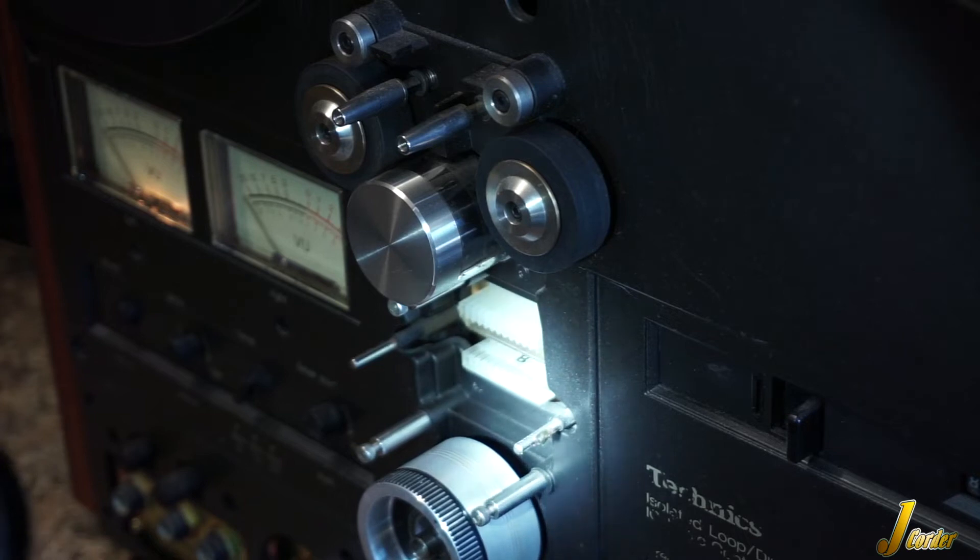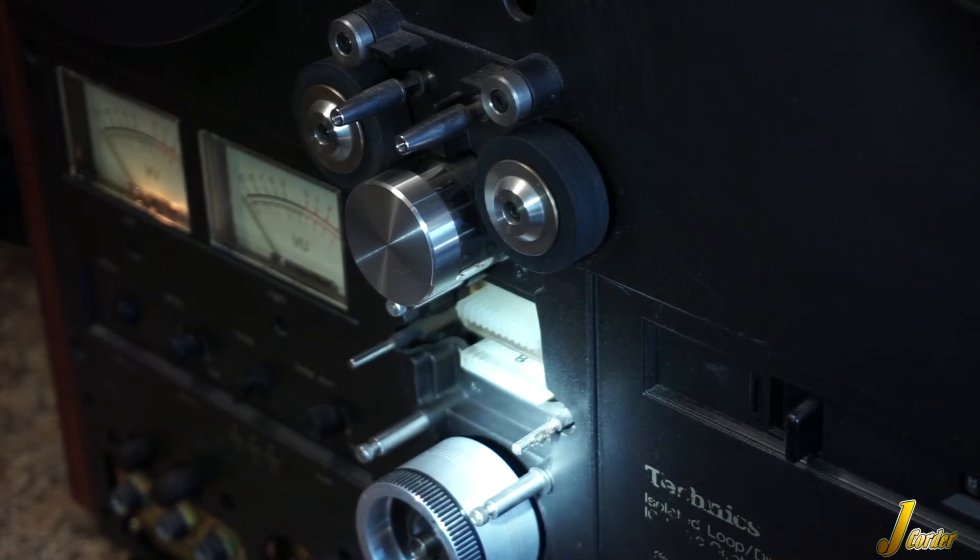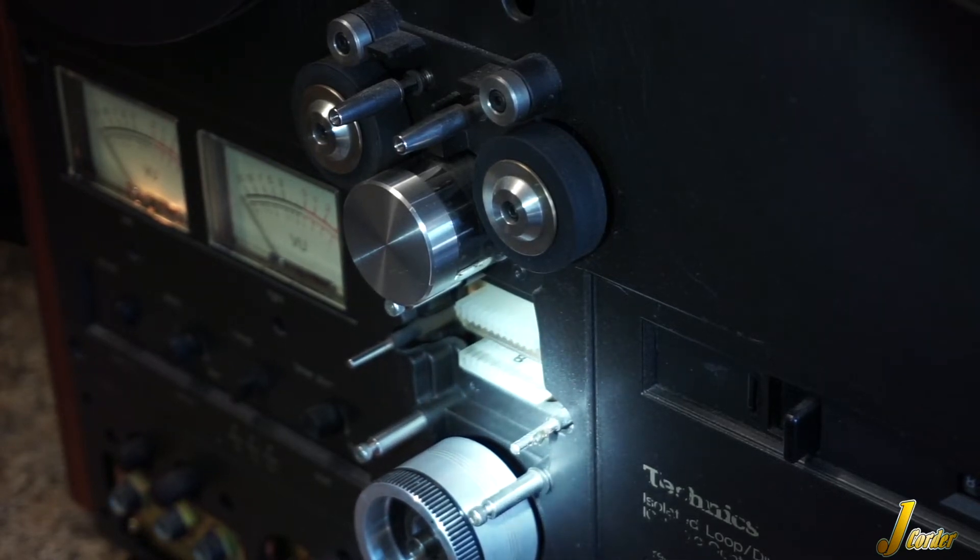If you have the rollers versus static lifters, it's plain and easy to see that the rollers aren't going to be putting any stress on your tape — it isn't going to be wearing that tape down. It's going to let your tape transport work a lot easier because you're not dragging that tape across a static tape lifter. It's a roller, so your motors are going to work easier and everything on your tape deck mechanics is going to work easier with the rollers.